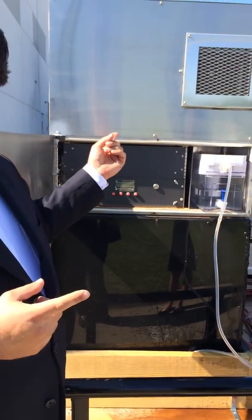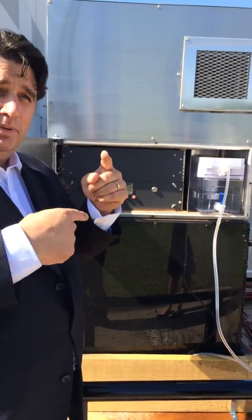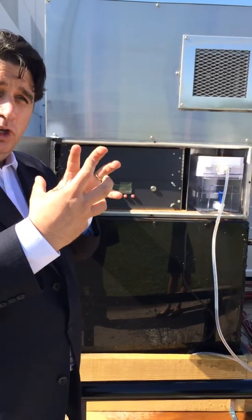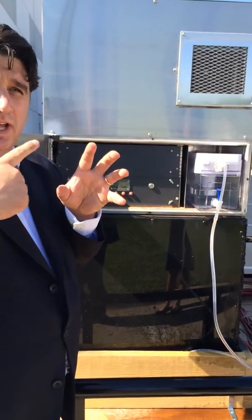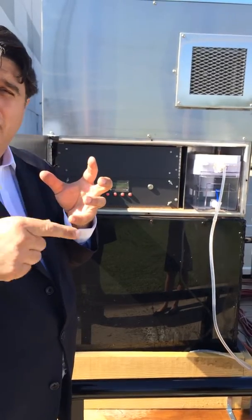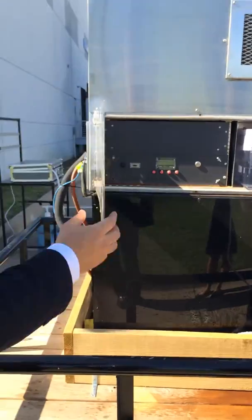So step one, phase one, absorption. Phase two closes those vents, and there's an internal circuit that heats it up and gets the air humid. The second half of phase two is to extract it, once it reaches that critical density of humidity, through the condenser, and out you have water. What we do with it next is this.